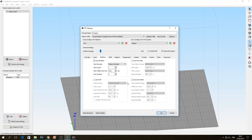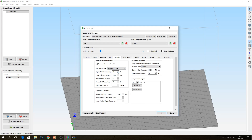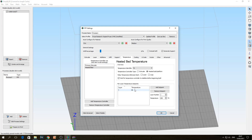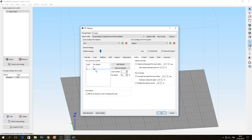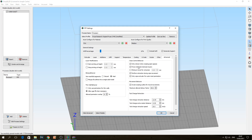I used a skirt as always. Everything else was unticked. Infill is set at 20%. Support was generated for 30% infill percentage — the reason being the bottom of the vase has quite a steep curve, so I wanted to compensate for it just in case. Temperatures were 80 on the heat bed and 250 on the hotend. Now this is where it's quite important: for the first layer I did zero fan speed and then 100% for the rest of the layers. However, you have to uncheck the adjust printing speed because you want a constant speed for the whole print, apart from the first layer. I set the default printing speed at 50 millimeters a second and just changed the speed for the outline. And that was basically it.